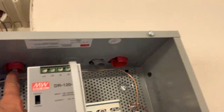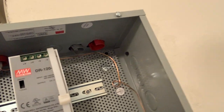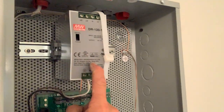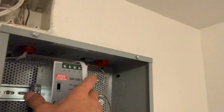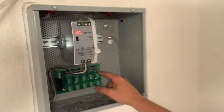I put a 3/4 inch knockout RC50, RC75 red bushing there. I could get in 2 more modules with that. But again, if this only runs up to 3.3 amps max, I could definitely get myself four of these in there. I could do 40 blinds on that. So this guy could run this whole board, essentially. I ain't going to need another circuit. They're looking at kitchen in the future.